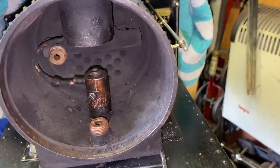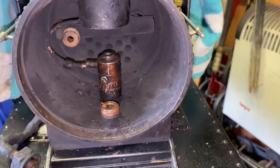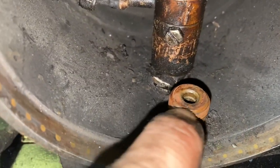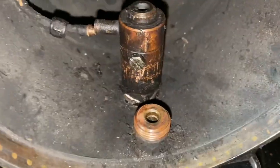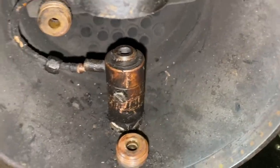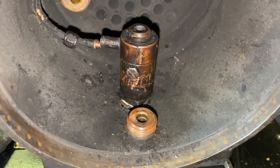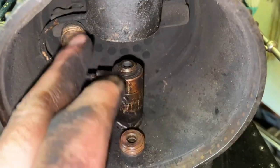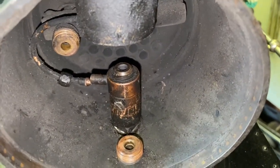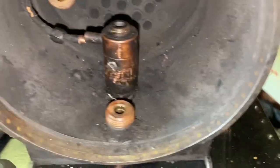On the downside you need to fit a decent size spanner in the gap. I'm starting to think that maybe it was this that was leaking — if it was spraying a little bit of steam out, that would have caused what we were seeing. I don't think there's anything wrong with it now; I've put a load of PTFE tape around the gaps to squeeze down on it, so that should be a good seal now.